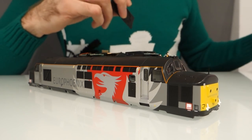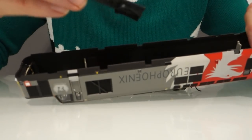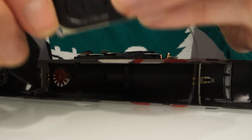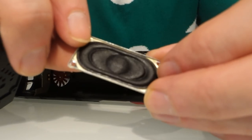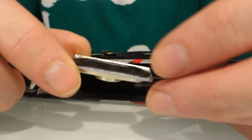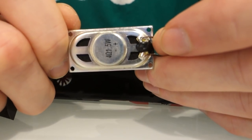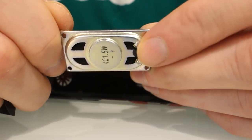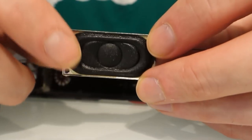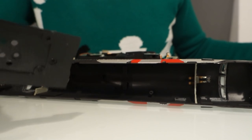The first thing I've done is unscrewed this from inside — that's what the speaker is attached to. It was just one of these 20 by 40 speakers. These speakers can sound okay but they really need to be in an enclosure. If they're not in an enclosure, all the air just escapes out of the back instead of coming out the front like it's supposed to. I know that if it's in a sealed enclosure it sounds significantly better, but you won't be able to fit that into this model anyway.